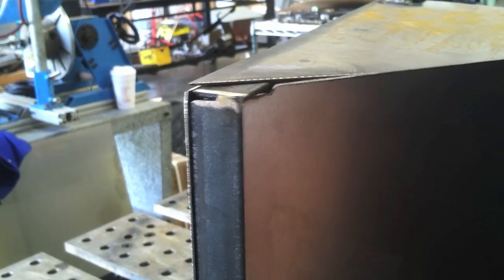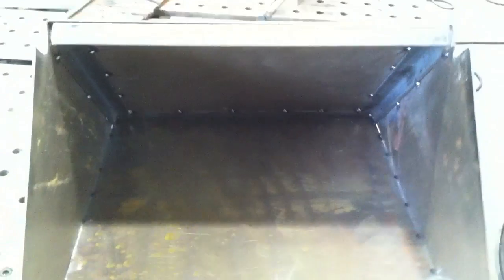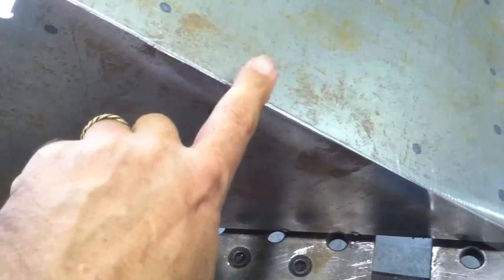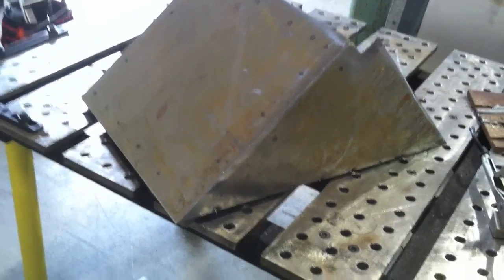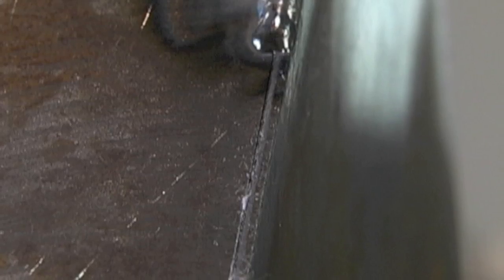Got a little coping to do here, something I didn't account for. But once it's all tacked up, I've got a lot of outside corner joints to weld. The outside corner joint is one of the easier joints, and since this has got a little angle on it, I'm going to position it and scoot downhill. Got it all tacked up with the angle — don't even need tacks on a lot of it on the outside. I'll set it on the table and weld at kind of a 45 degree angle downhill, which makes it go a little easier.